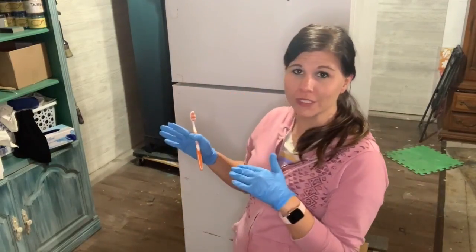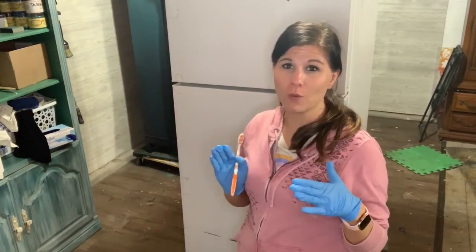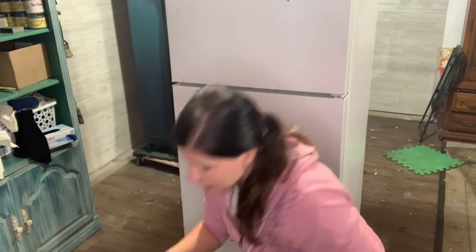The first thing I'm going to do is clean this whole thing with White Lightning Cleaner. White Lightning Cleaner is a product from Dixie Belle, and it is a degreaser. We want to get all the grease, all the oils, all the dirt, all the sawdust off of this piece. I mix about a tablespoon with hot water in a water bottle and shake it up really good. I also have a bucket of hot water to rinse my rag. I'm going to clean the whole piece, then rinse it with clear water.